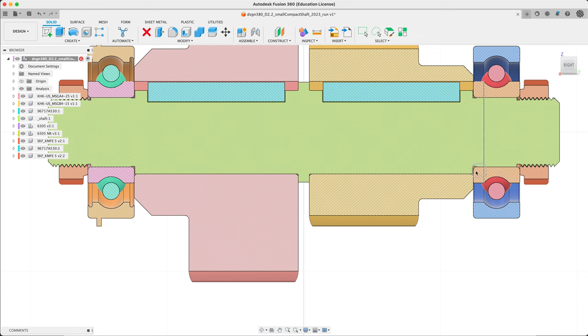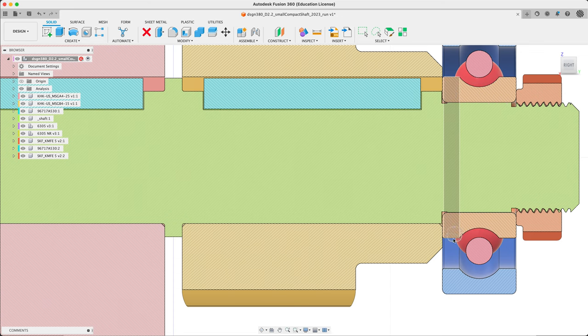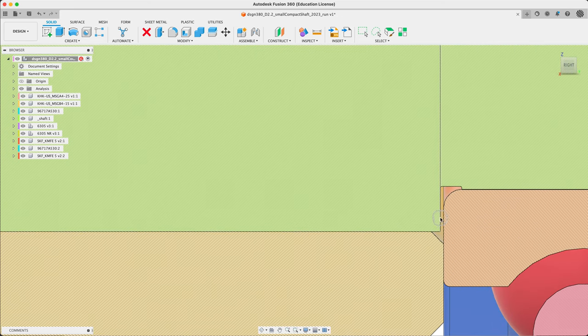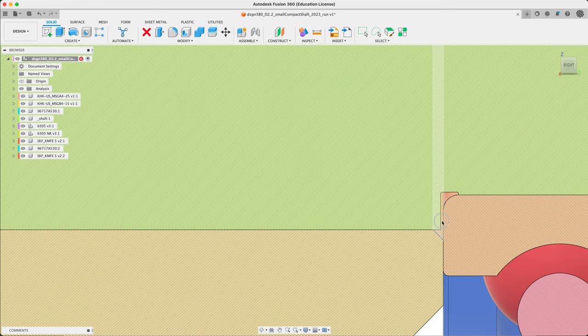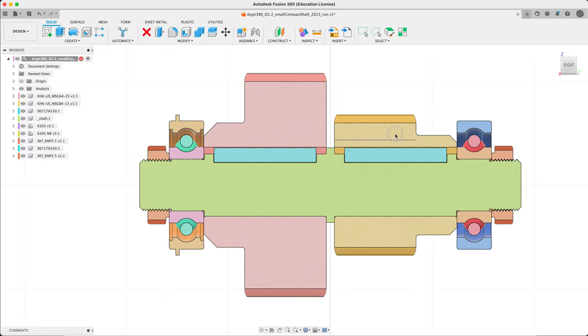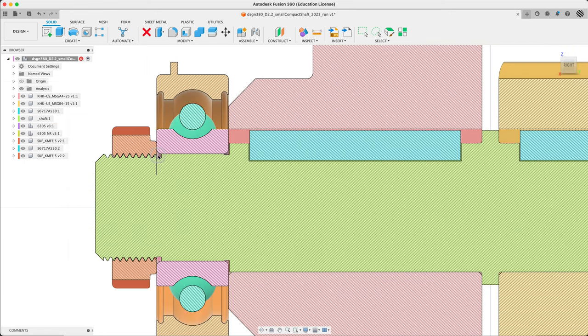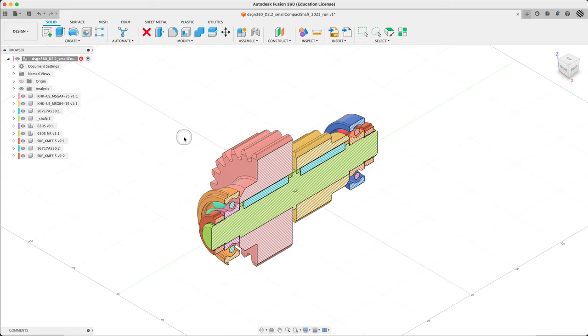There is a very small gap between the shaft and the bearing, so we're avoiding a double fit. Otherwise fairly standard — little gaps here to keep the KT under control, and a little recess for the end of the threads. Otherwise, standard parts, no surprises.